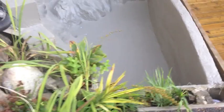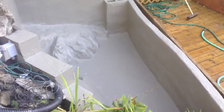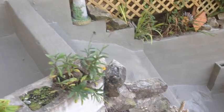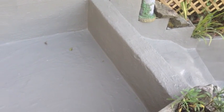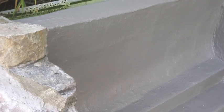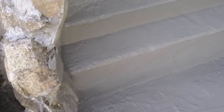You throw it in a barrel or wheelbarrow. Basically you take the Krill 60 — it is one part Krill 60 and three parts water — and you just mix it together. You leave it for 20 minutes, then come back and mix it again, just to make sure it has soaked properly and there are no inconsistencies, dry spots, or lumps. Mix it again and make sure it is as smooth as possible and fairly runny.